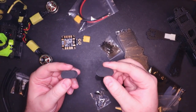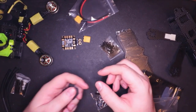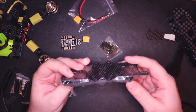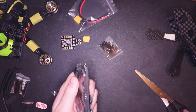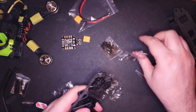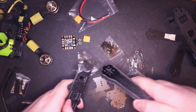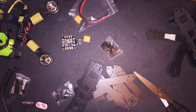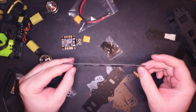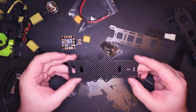Typical standoffs, and it looks like it comes with some nylon standoffs as well for your flight controller — those are pretty handy. And feet. Honestly, I've never really used these. I put them on one of my builds and then had some issues I had to take care of, so I took them off before I even ended up flying with them. So there's all that. Let's check out the frame here. You can see the carbon fiber frame all wrapped up. The top plates look to be about one and a half mil and they feel pretty durable. The bottom plate is definitely a two mil bottom plate, and the arms are four mil.